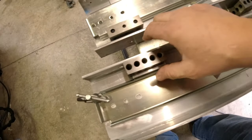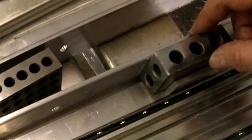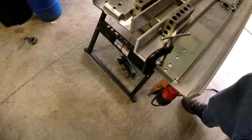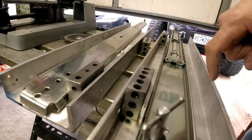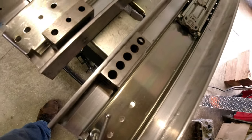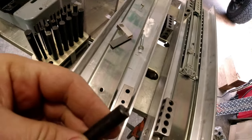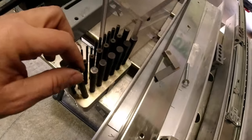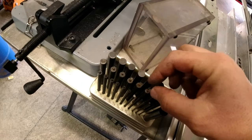To space these slides in the frame properly, I'm using 1-2-3 blocks and a piece of quarter-inch material. Since this material has a radius on the bottom, I've got it sitting up on a piece of quarter-inch material. You could just mark it with a pencil, but just like we have transfer screws, there are transfer punches as well — a little punch with a tip on it. They usually come in a full set. That's not to say you couldn't just trace it, center punch it, and go from there.